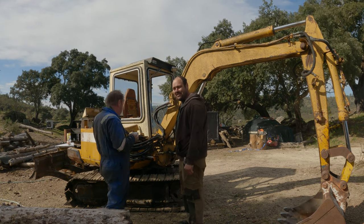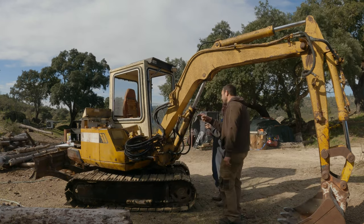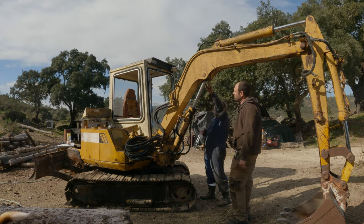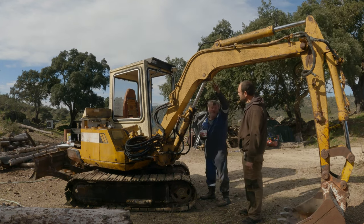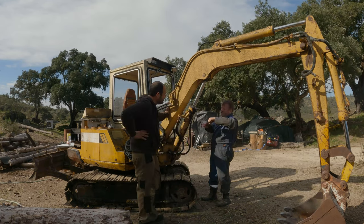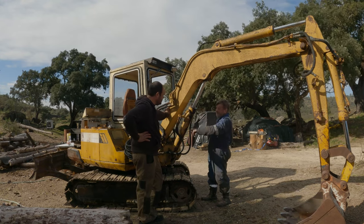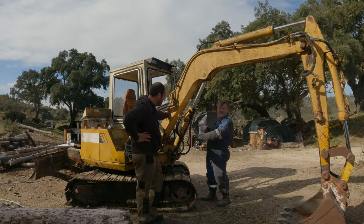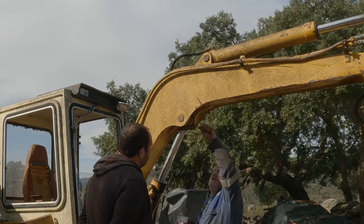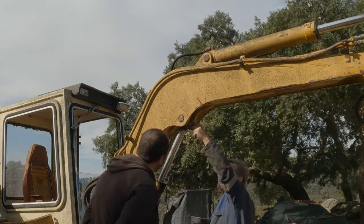Apparently my digger has nipples — lots of them. You basically need to grease your machine; it's the lubrication system. If you're working your machine and you're getting a squeak, it needs grease. It should be greased to avoid squeaks because squeaks are two bits of bare metal rubbing, and there's no need for that. Every cylinder or ram has a pivot at each end, and each of those pivots has a greasing system. There'll be a grease nipple in the end of the pin where the grease goes in along the pin and out into the ram.